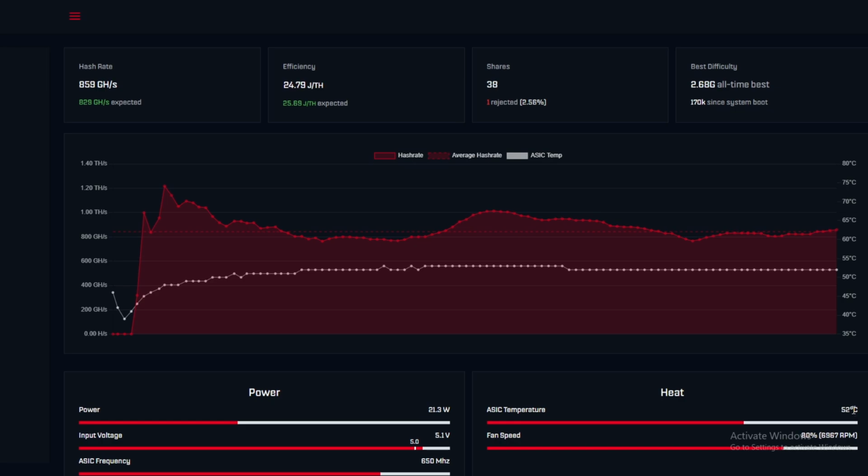So overall, I think from looking at this at least, and looking at the Gamma, how it functions on that, these heat sinks are really good if you're wanting to really go for higher overclocks, because they'll take the temperature down much more at those higher watts that you can hit. I wouldn't necessarily recommend it if you're just putting it on, let's for example say the Bitaxe Max. I don't think it's going to do too much, but definitely for the Gamma and the Supra, recommended. Gamma is probably the best improvement I've seen. I think we had nearly over 15 degrees drop in temperatures, and that's pretty big in terms of how much heat dissipation you can get and how much more overclocking you can do on these machines. So definitely would recommend them.